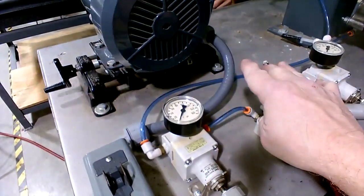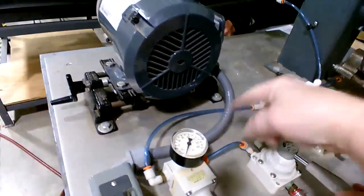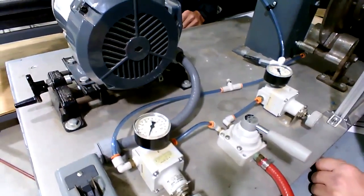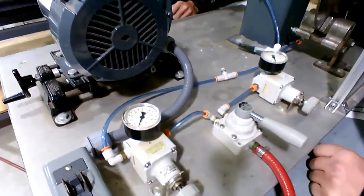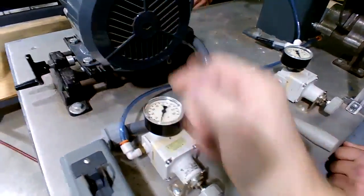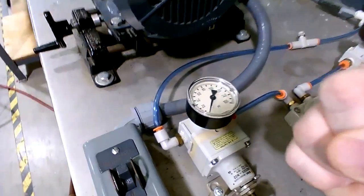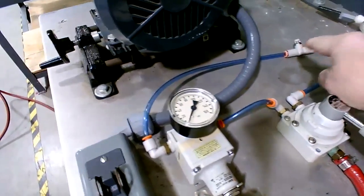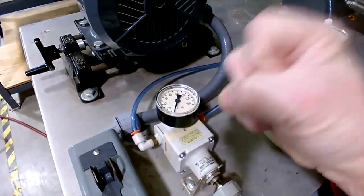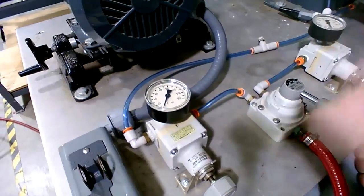So that's everything that you can control on cylinders, whether it's a cylinder or a clutch mechanism like this, it's the same principle of pressure and speed. On plant equipment or in any type of industry like that, if you want maximum pressure but nice and slow movement, you jack up your pressure here. You can go high here to get a lot of push, but slow it down with that flow control and have a very powerful push, but slow. Very strong with PSI, but slow getting there. Otherwise it does a slam and break thing.